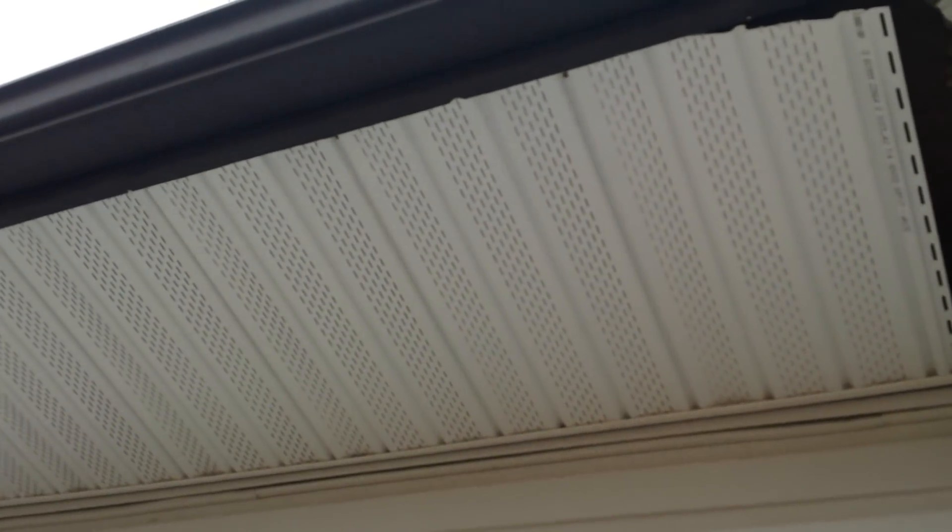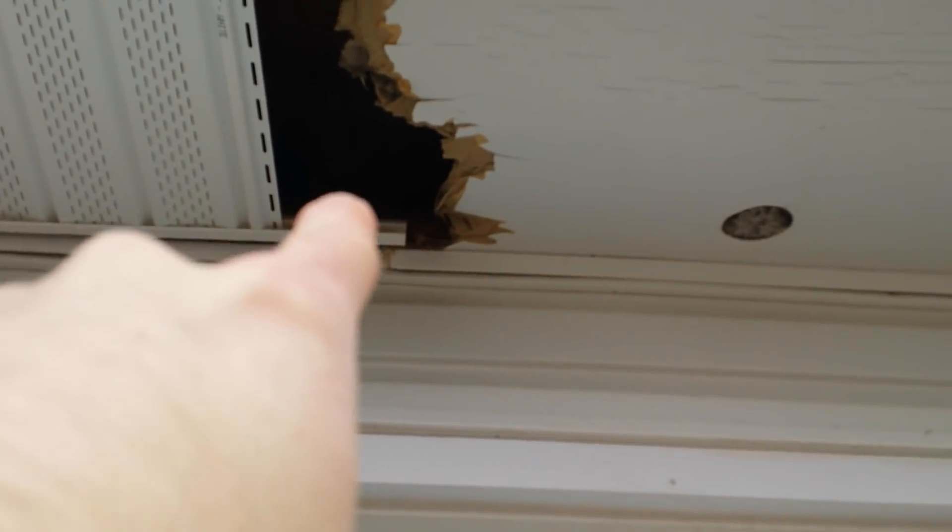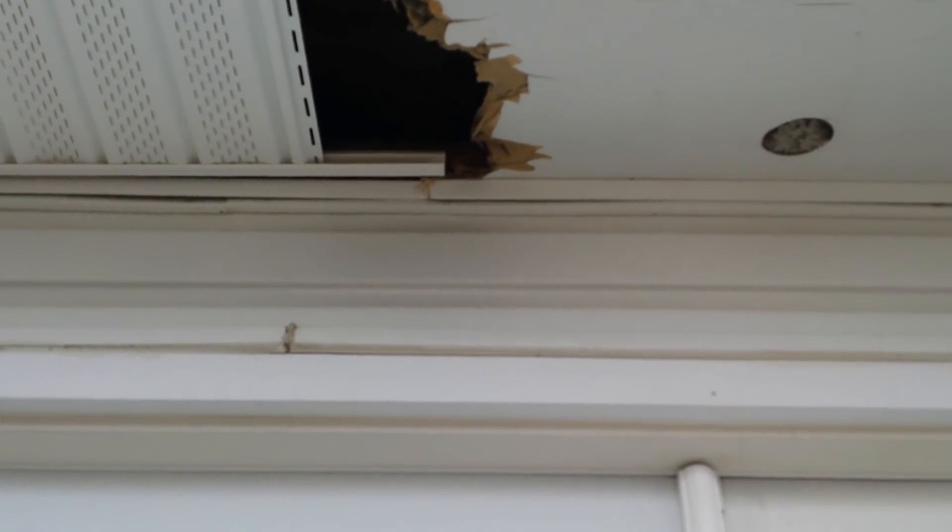I'm hoping it doesn't make my house too cold from putting full venting the whole way. I don't know - I've looked at a lot of houses and they don't have vented soffit at all. I think there's a balance: too much venting, too little venting. Hopefully this isn't too much - we will see. If you put another piece you just put the F-channel right next to it and put a little strip of white caulk in between to make them look good. I did J-channel right next to it eight years ago.